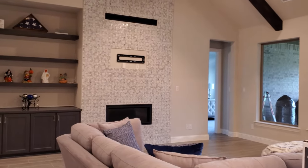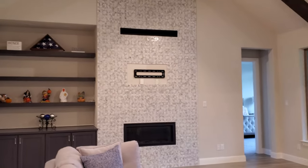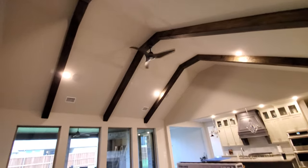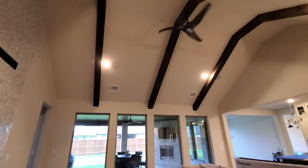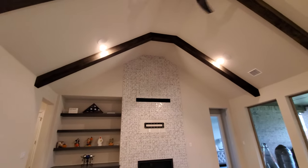We're going to start here in the living room. The customer went with a partial builder's package from the preferred vendor for some of their low-voltage stuff, which included some pre-wiring as well as some speakers. Originally, they were pre-wired for the front speakers to be on the other side of this beam, which you don't see at all, and where the seating position is way over here. Rule of thumb with this sort of stuff is if you can't see it, you're not really going to hear it very well. High frequencies are directional and you want them going toward you. So I consulted with them and recommended they relocate the speakers on the other side of this beam, which they were able to do. Now from the seating position you will be able to hear the speakers much better.